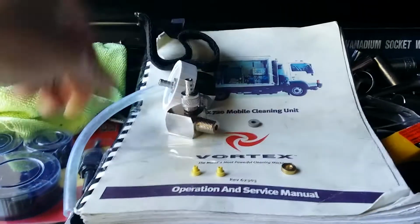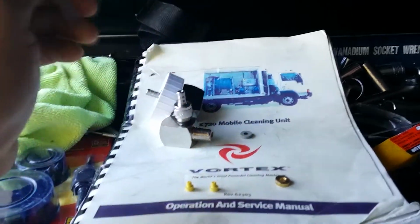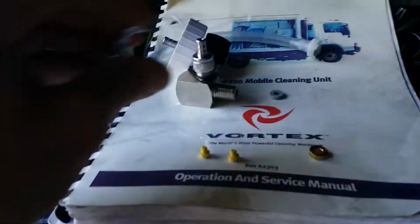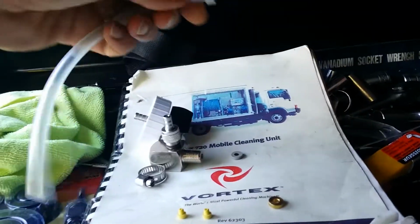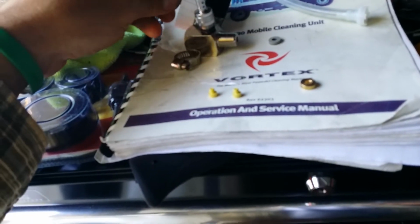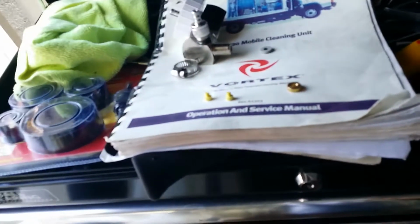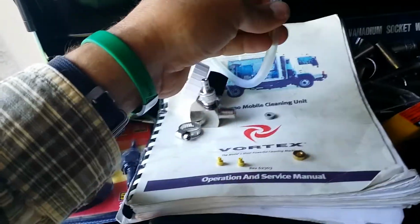You put that on there and you take your draw hose, stick it on, and use the smallest diameter hose clamp to hold that on there, because all that swishing in the bucket, sometimes they can fall off. I usually use a larger or a longer hose so that it goes into the far corner of the 7-quart, which is a much flatter, bigger, wider sprayer than this little thing, which I won't use. I'd go through this in 2 bedrooms. I've even gone, as these things age, they stiffen up from sitting in the chemical. And I'll put a nut or something, kind of weigh it so it sits at the bottom versus curling up and you're always sucking air.